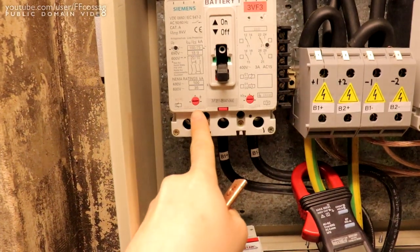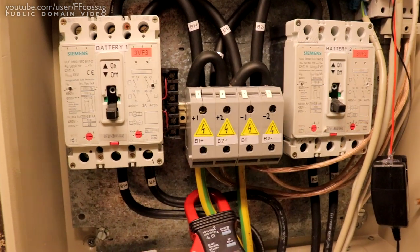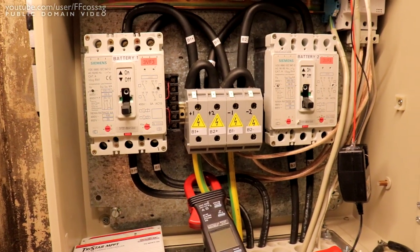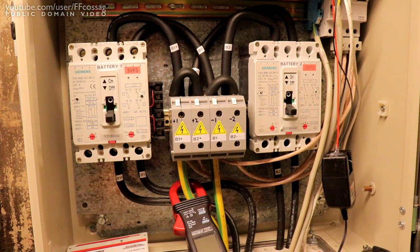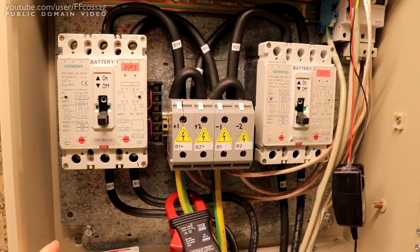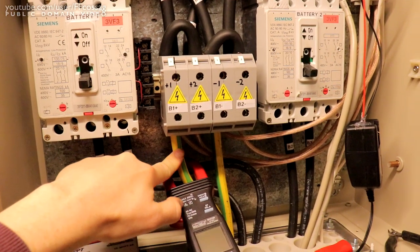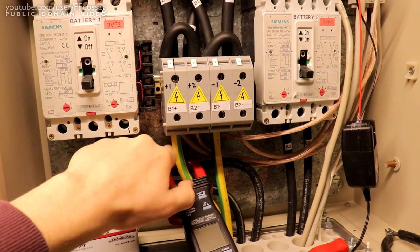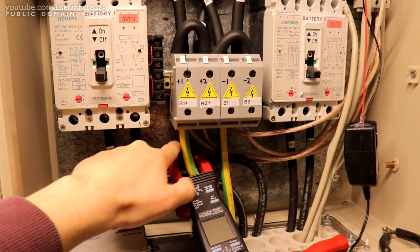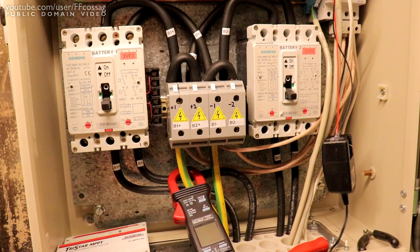And if I set these to the lowest possible value, we have a total combined breaker current setting of 250 amps. So I'd have to step up to like 100 square mil for that to be acceptable, because we don't want to be in a scenario where any condition can cause overcurrent in these wires and a subsequent overheating, with dripping plastic on things and burning copper and glowing things which should not be glowing. So we have some things in the works.